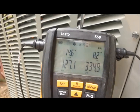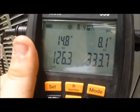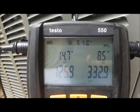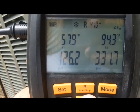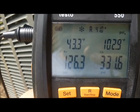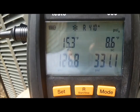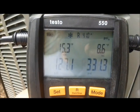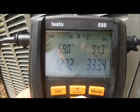I had to add just a little bit of refrigerant, which I figured I would. Everything's coming down nicely. Target subcool on this Trane system is 10, and as you can see right here we're at 8.3, 8.1 with a 14-degree superheat, so the TXV is working great. Pressures look good. T1 is 57.9, T2 is 94.3 - that's direct from the clamps on the suction line and liquid line. The evaporator is at 43.3, condenser is at 102.9 - everything looks good. I love the Testos. If it stays right there in that range I probably will not mess with it, because it is plus or minus three on these Trane systems.